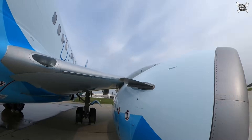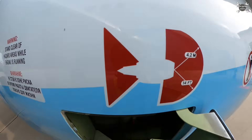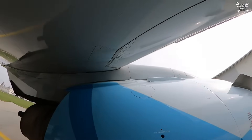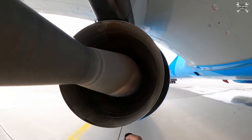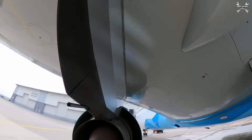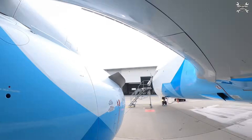After that, I inspect the engine oil level. This inspection should be done 5 to 60 minutes after engine shutdown, though this can differ from engine to engine. Then we take a look at the fan cowls and C-ducts, inspect the bypass section for delamination or damage, take a look in the hot section, and of course inspect the vent tube. Next, I take a look at the pylon for missing screws, rivets, or any other sort of damage.